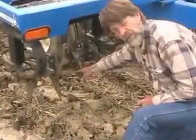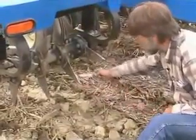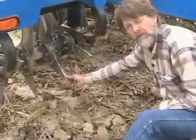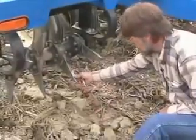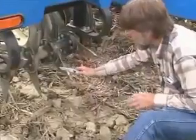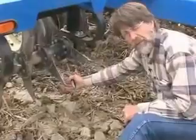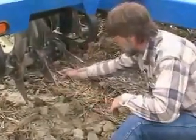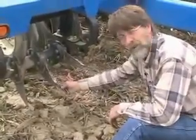It just shears it. This tip of the tine down here is the propulsion face. This contributes to the actual forward rotation of the shaft. As it goes down into the hole, it creates a rotational force. So the back side of the tine, which is not visible to you, over here is actually radiused and tapered so that at a 0 degree of offset on the roller shaft, it actually creates thrust forces on the back side of the tine as well as the front.